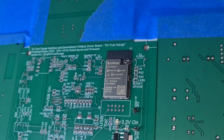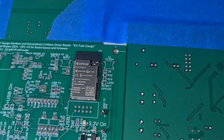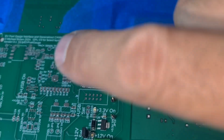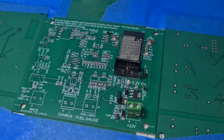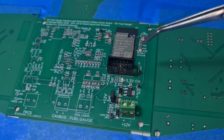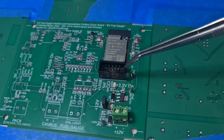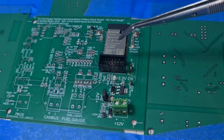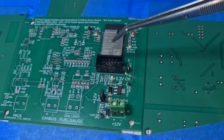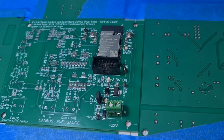It's marginally out of alignment because, of course, everything slips. Now I'm going to put these components in for Blinky and for the flash and the boot buttons. Okay, I've got this whole ESP32 section soldered in and the JTAG debug header. Technically, I could power it up, plug my laptop in here with the ESP-PROG board, download software into this, and blink the LED at this point.